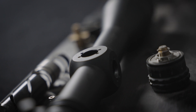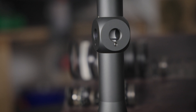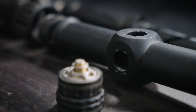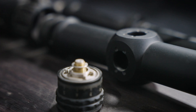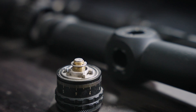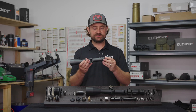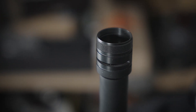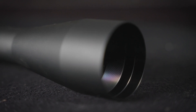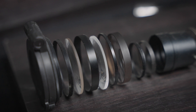In the center of the body tube you'll find mounting points for turrets, side parallax, and illumination dials, and these are normally in the form of threads or threaded holes for screws, or a combination of both. At the rear you'll also find a cutout for your magnification mechanism and a mounting point for your ocular tube. You may also notice threads inside the tube itself — these are for installation of lens assemblies, which are held in place with bonding agents and lock rings.